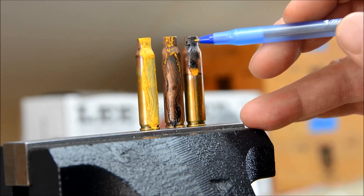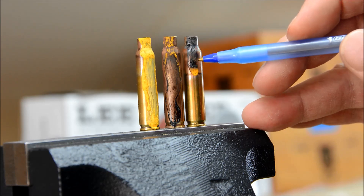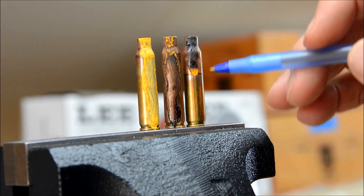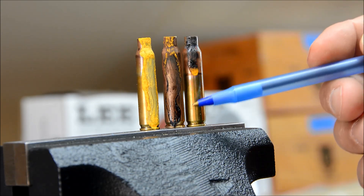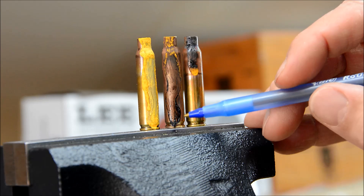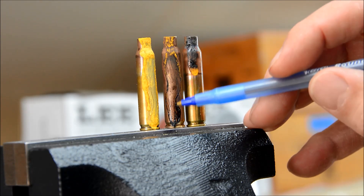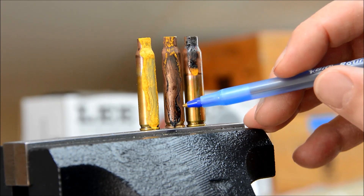But there is some carbon — heavier carbon built up here. There's clearly black colors through this area where the flame does not directly reach. Here's the one we ran from the bottom up using only conduction — we had the torch underneath the plate, heated it up until the heat was conducted through the plate and through the bottom of the brass. You can see how it moves up the case, going from a dark clearish color, but at the edges it turns black nonetheless, and that's without direct flame.